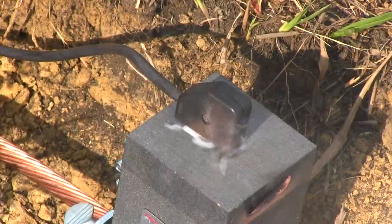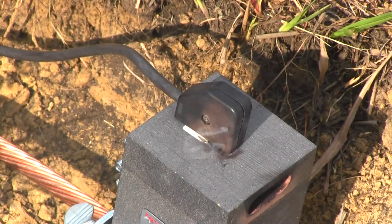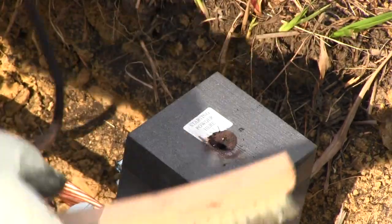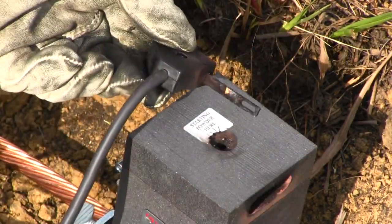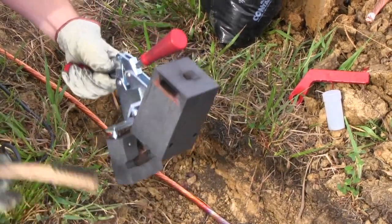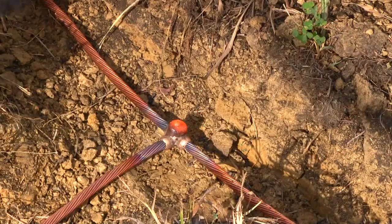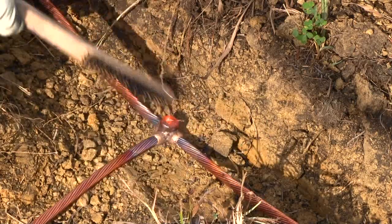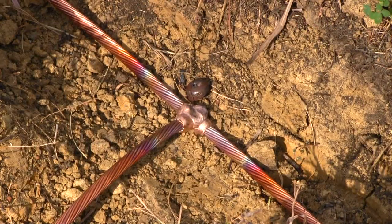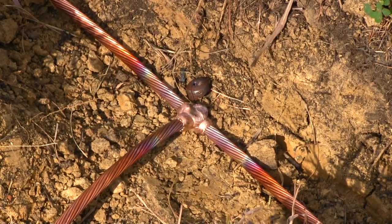The EZ-Lite Remote responds immediately — there is no lag time. We recommend that you wait approximately 15 to 20 seconds allowing the weld metal to cool slightly. Remove the igniter strip and open the mold. Clean the mold with a soft bristle brush. This prepares the mold in advance for your next weld. Knocking the slag off the weld not only cleans the weld but it allows you to check the quality of the weld, looking for porosity and other imperfections.